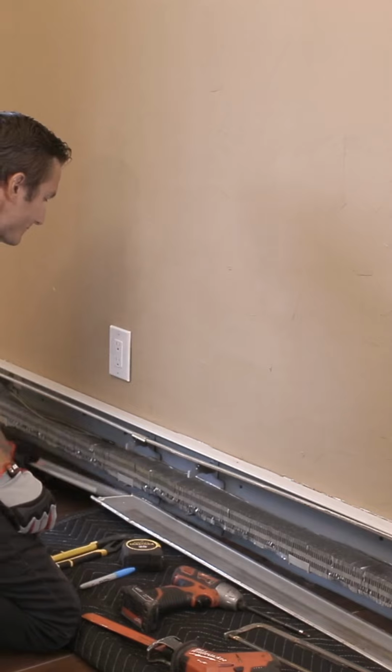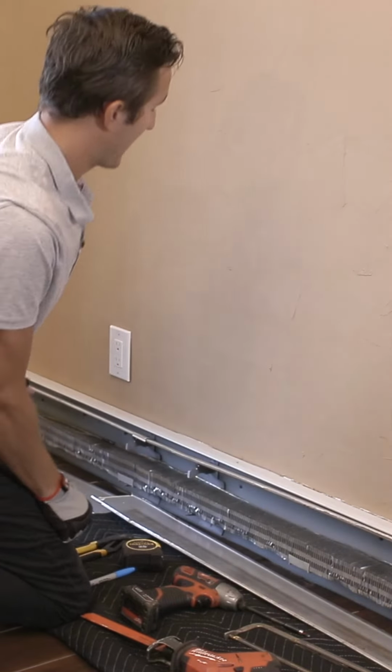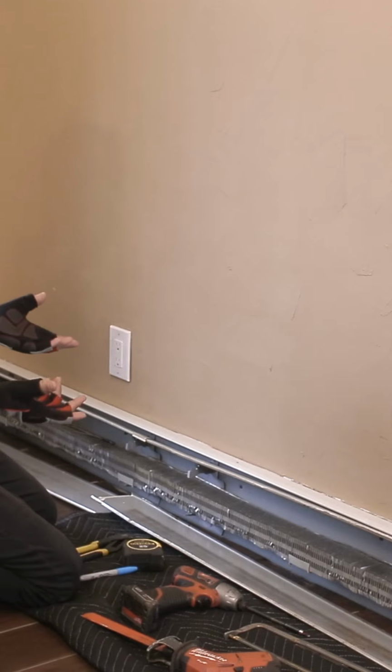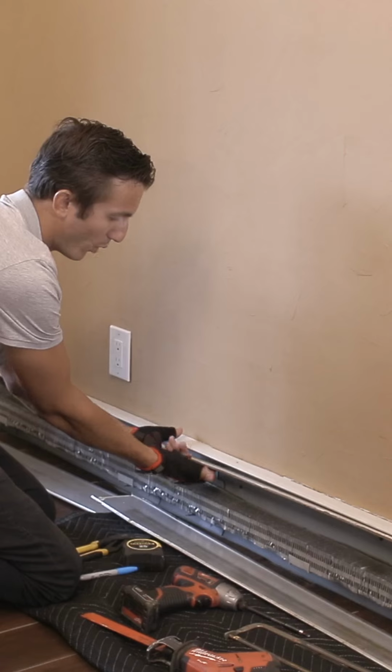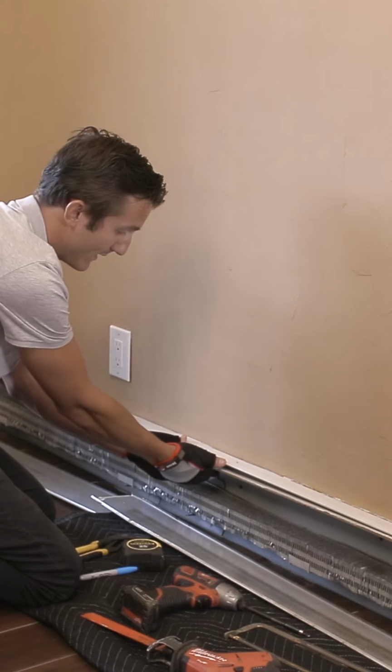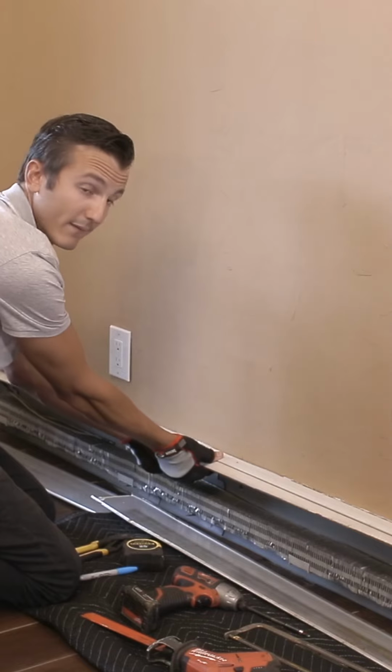Same here. In order to remove the adjustable slat fin, the way I find the most simple way to do it is place both hands on both sides of the metal bracket inside and pull towards you. It will release the clip from the bracket.